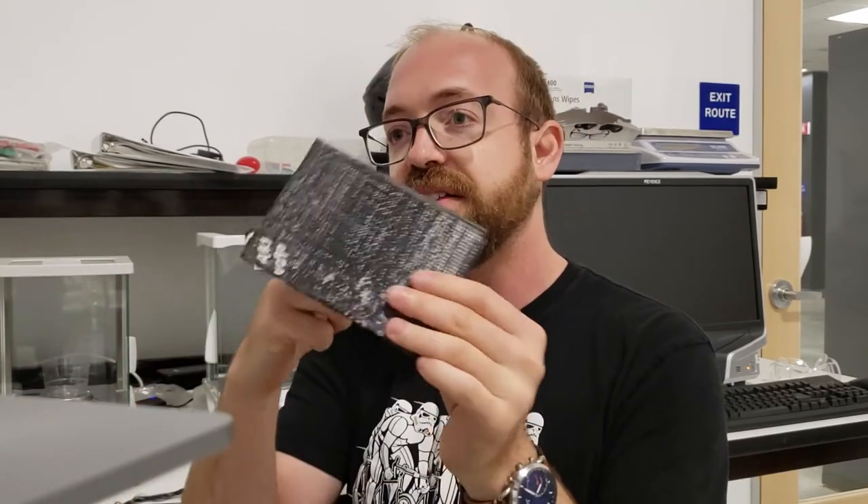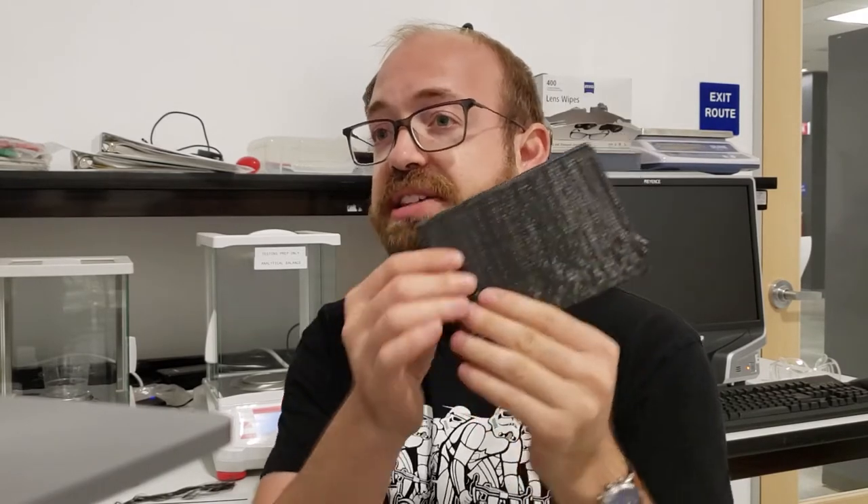I can make other test coupons — this is just a bunch of plastic and carbon fiber, but carbon fiber in exactly the right place, as dictated by our design software that helps figure out for a given load case. Let's say this part is going to get bent like this; I might orient fibers differently than if it was going to be pulled apart like this. When you take all of the software together, it tells you where all your fibers need to go, and you have a robot that allows you to place fibers in whatever orientation you want, and an additive manufacturing process that can build up structures as you go — as opposed to using a liquid thermoset which might take hours, days, or even weeks to fully cure. Now you have a rapid process that can make real structural parts with strength that is meaningful to things you interact with in your daily life, and you can make them very fast. That's really the magic of additive manufacturing of composites.